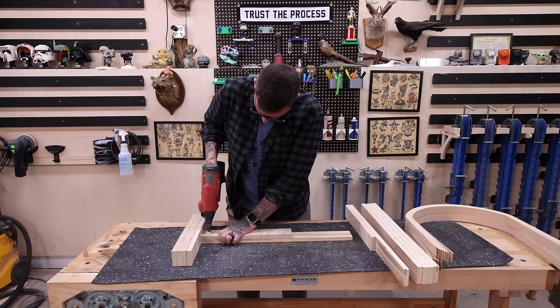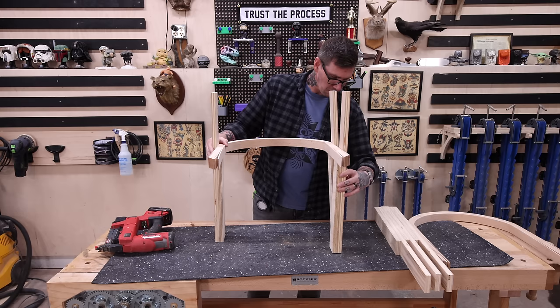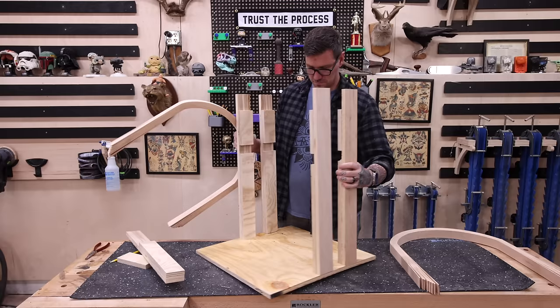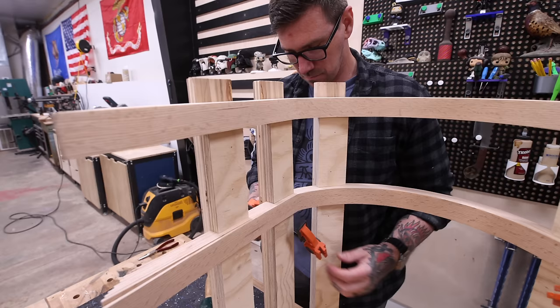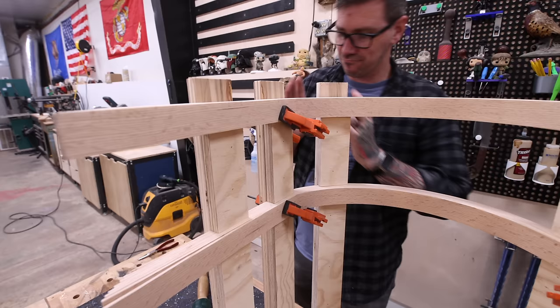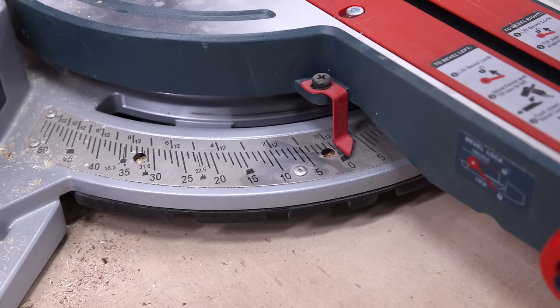So far I know what I want this chair to look like, but I haven't fully figured out how I'm going to put it all together — at this point I'm just winging it. The challenge with gluing up these curves is spacing the upper and lower curves correctly while slotting in the finger-jointed strips that create the front legs. So I came up with a large jig with a lower platform the legs reference off of, and plywood uprights with spacers that hold the curves at the proper height and keep them parallel to the floor. Not very elegant looking, but it gets the job done — which, now that I think about it, should be my slogan.